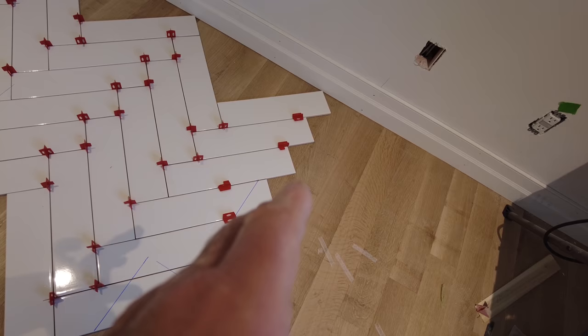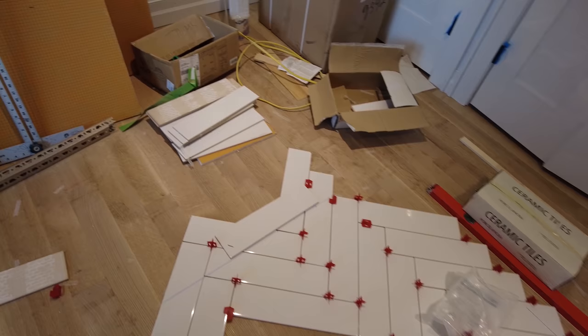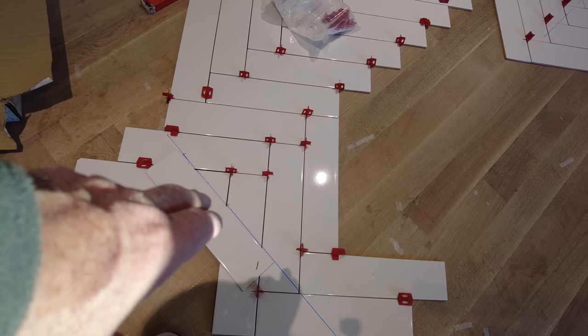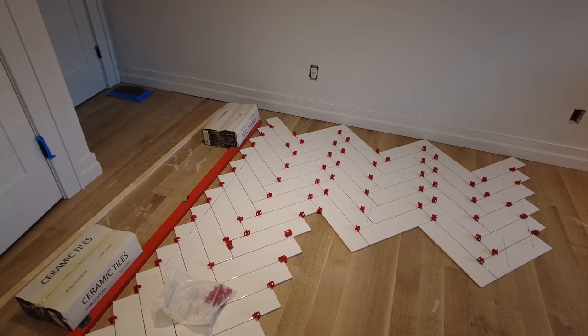On the other side I don't need to wrap the corner because it's just going to be a Schluter edge, ending inside the knee wall. I also get a very good piece to wrap around that short wall on the tub deck. This tile going across here represents my tub deck, and these are the pieces I'm going to get going across the bottom of the tub. This is the easiest way to figure out what piece you're going to get in the corners.